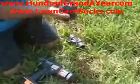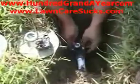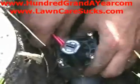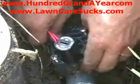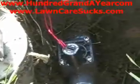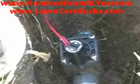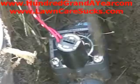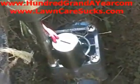All of that is contained there in my hand, and I'm going to place it on there gently at first and move it around so I can determine if I can turn these screws in a little bit with my hand, which will do two things. It tells me that it's in the right place, and it also tells me that it's lined up correctly. So I'm not going to screw it in all the way with my drill because it is a plastic valve and we could easily crack it if we crank that drill all the way down.